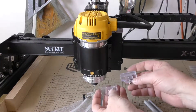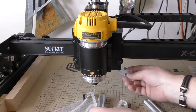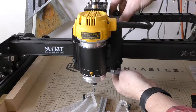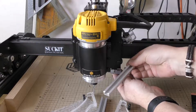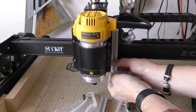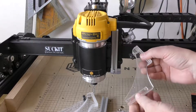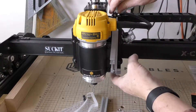These little brackets are clear and have a closed side and an open side. Find the closed side with the screw in front — that's going to slide right on top and butt into the side of the plate. You have to slide this piece into the aluminum extrusion track, and then tighten up the little allen head screw just a little bit. Take one of the dust boot supports — make sure the magnets are on one side and the groove is on the other, with the groove facing in toward the spindle — and slide it on.